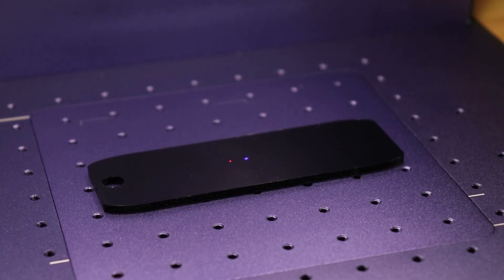There are two ways to focus this module. There is a little button on the back to manually focus the laser. When you focus a galvo-style laser like this, it has two little dots and you want the dots to meet in the center. There's also an auto-focus button on the back, or in the software you can just hit auto focus once you put your material inside. There is a camera in here to position your designs — in the software you can position designs using the camera and also frame out your designs to know exactly where they're going to land on the material.